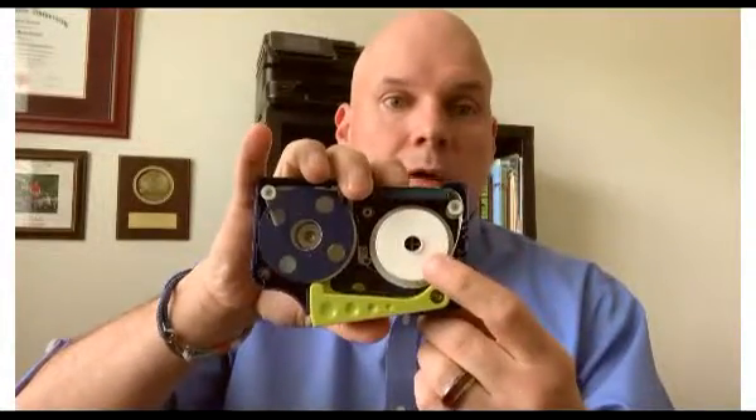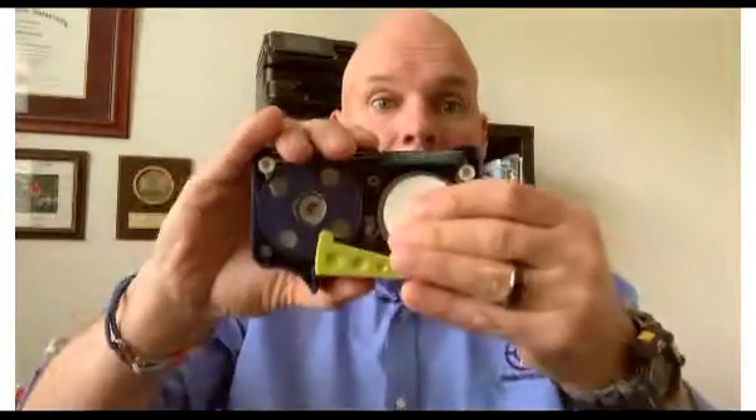To give you an idea of what goes inside a traditional cassette, I opened this one up. You have your cleaning ribbon in here, and what happens is it flows into a window area that's protected by a shutter system, and then as it gets done, it comes over here. When I pull the trigger, two things happen: it advances the cleaning ribbon and opens up the shutter, and then when I let off, the shutter system covers up the used material in the ribbon.